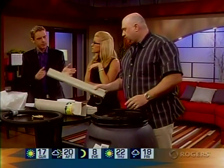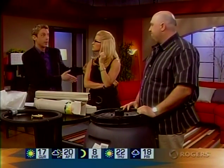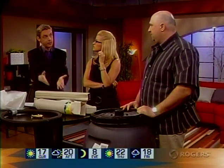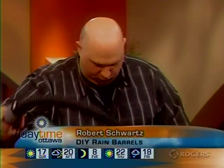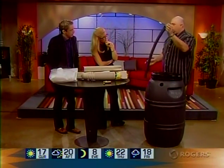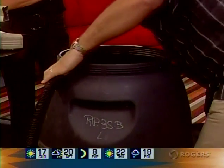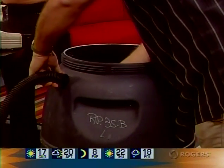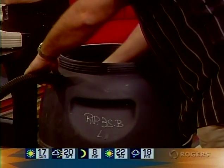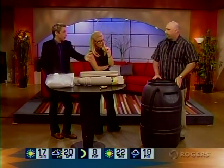Because they overflow, is it better to put the barrel away from your house? Some people are worried about the foundation and water getting in. One of the things I drilled in here is an overflow port on the side of the rain barrel, and this is an overflow hose — just some pump hose and plumbing fittings. You insert this into the hole, and as your barrel fills up, you route this to an overflow point away from your house. You can even have that overflowing right into your garden.